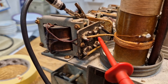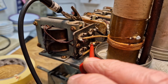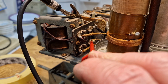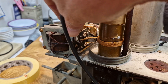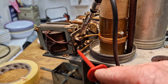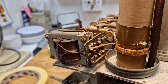So here's that intervalve transformer. I've got one wire connected there, the other one here. This is the three to four tap — according to the service data it should be around about 10K or 11.2. So that's perfectly good enough, we know that side is okay. Let's have a look at this side. It should be about a thousand — bang on, 1.03K. So perfect. We know the intervalve transformer is okay, and I've already checked the output transformer — that's good.